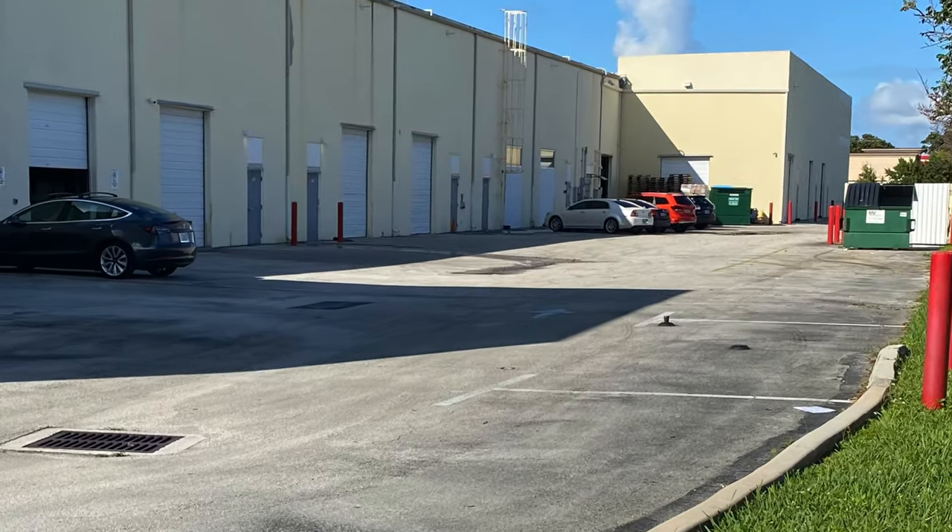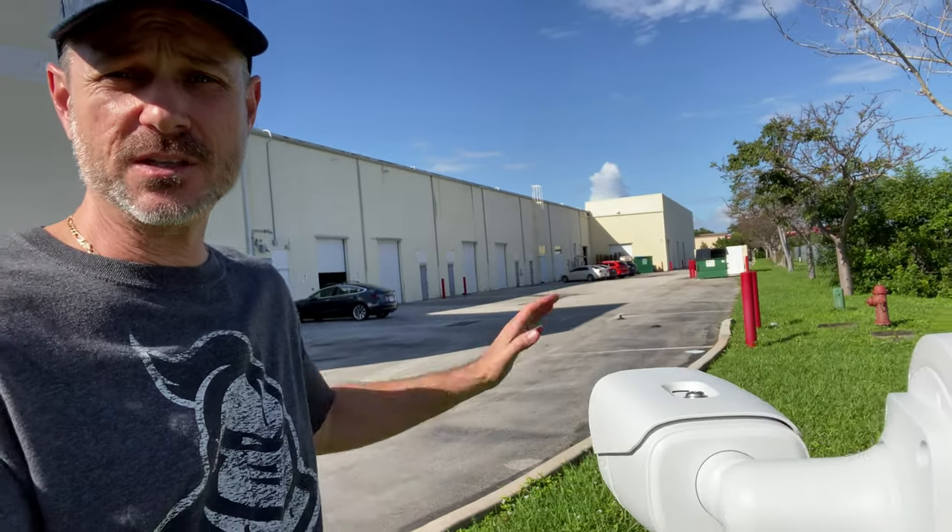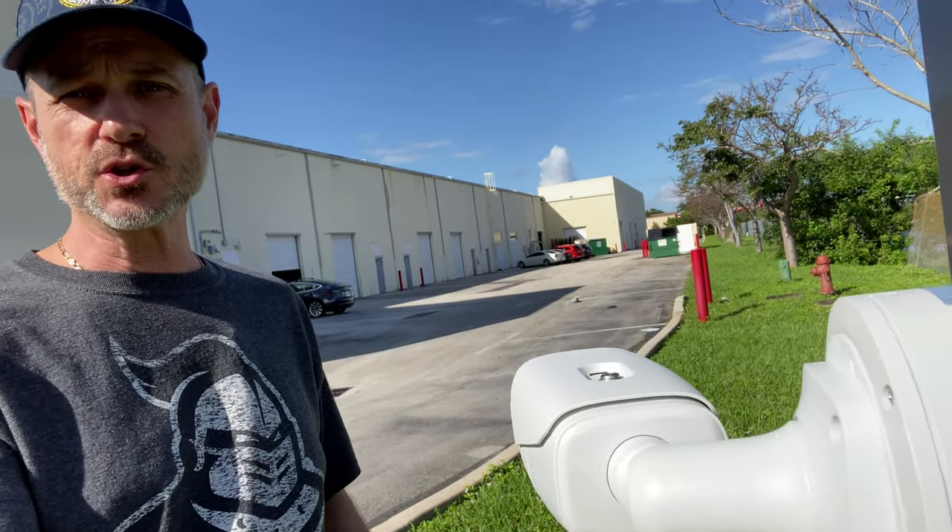Another thing to consider is the distance between the camera and where the license plates are crossing. This camera has a 7 to 22 millimeter lens. It's capturing basically a single lane of traffic, which is important — LPR cameras are meant to monitor one lane. The detection zone here is 70 feet from where this camera is mounted. I have the 7 to 22 millimeter lens zoomed all the way in, and this camera is rated up to about 70 feet or 21 meters, which is what we're using here.